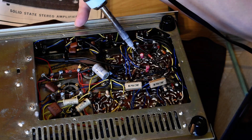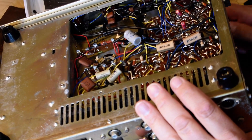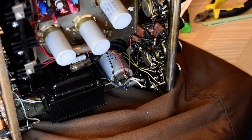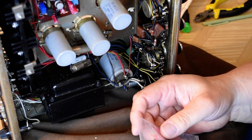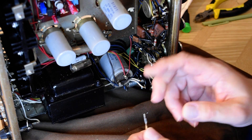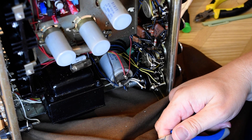Why did they do this? They probably had some issues with this board the way it was — that happens. Let's see where my capacitor went. I'm just going to swing this thing up. Let me do a little wiping off with a Q-tip. So there's the one I'm replacing, and it seems every signal cap inside this version is a 10 microfarad — isn't that interesting? Maybe they weren't quite into saying 'well a 5 would do and it's a third of a cent cheaper over a thousand units.' No polarity markings, but I did look before and it's in my random access memory.